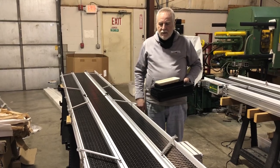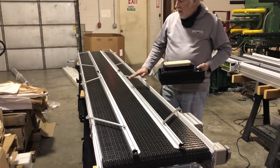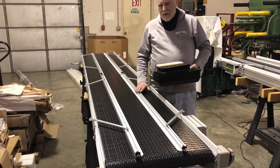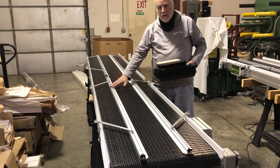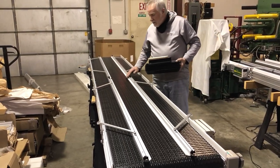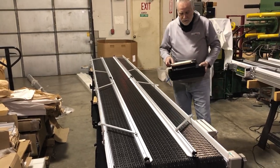Welcome to Safe Conveyor. Today we are testing the conveyor that we developed some custom guide rails for. They're going to be putting trays on them in different sizes, so they have the adjustability. They wanted to make sure that the trays didn't ride up onto the guide rails — these are guard rails out here. So we developed a custom plate on the bottom that holds them, and we're going to do this quick test.